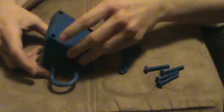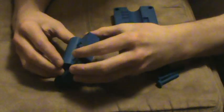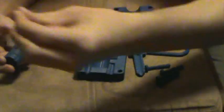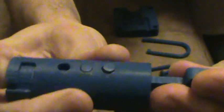Once the screws are out, you can take the negative plate off — that basically holds everything in place and the shackle is free to come out. From there, you can remove the barrel from the plate. You can see here the pins are driven by 3 small springs. The driving pins are housed in between the pin holes and the barrel. Inside here you can see the driving pins — where if you insert the key, they become flush with the barrel, which allows it to turn.